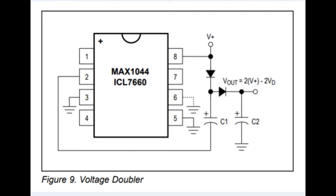Here's the circuit diagram for the voltage doubler using the ICL7660. We've added two more components — two diodes. These are switching diodes; I'm using 1N4148 diodes. Capacitors C1 and C2 are 10 microfarad capacitors. Whatever voltage we apply to pin 8, from 1.5 volts to 10 volts, we'll get double the voltage across capacitor C2. The output voltage won't be exactly double the input — we have to subtract two diode voltage drops. So if you have an Arduino Nano project running on 5 volts and want to drive a non-logic-level MOSFET, you can use this circuit to double the voltage from 5 volts to 10 volts.